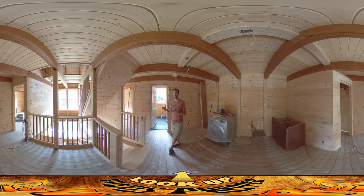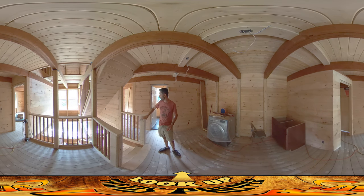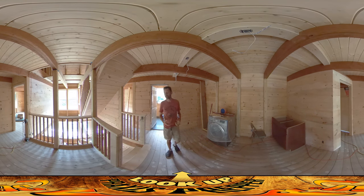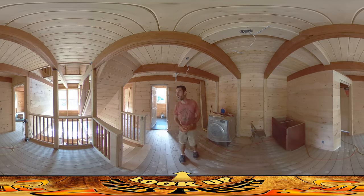What I wanted to talk about today was the electrician popped by. We had a question for him about the capacity of boxes. There are specific rules about how many wires you can have going into these boxes in terms of space. Different gauge wire is a little thicker, different types of switches — a GFCI outlet is not the same size as a regular wall flip switch, which is not the same size as a regular wall outlet. There's all sorts of math that goes into figuring out how much you can put into these boxes.